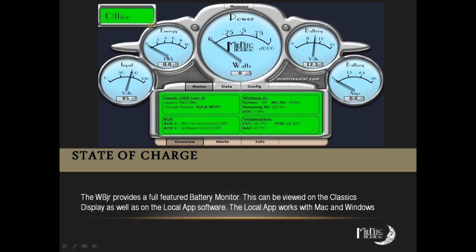A lot of people don't seem to understand very much about battery efficiency. So, you know, if this thing is incredibly optimistic and it's lying to you, we find that people are setting their batteries at 98% efficient or something like that. I don't think I've ever seen a battery bank at 98% efficiency. So, you know, maybe upper 80s for a flooded lead acid, low 90s for some others. But it is adjustable, and it'll take a little while to calibrate it, but eventually you'll get it calibrated nicely, and it gives you a nice accurate view of what's going on in the battery bank.